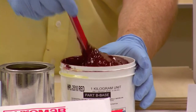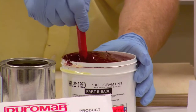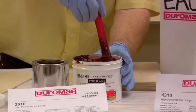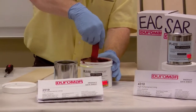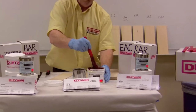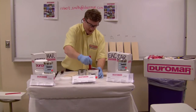This product we're using here is called 2510. 2510 has been with our company for pretty much the entire time. It was developed initially for water circulation lines, wastewater treatment, and water conveyance. 2510 is used throughout the power plant in many variations. Because of its long recoat window, this product can be used as a primer if you're going to be doing a lot of repair areas within your FGD system.